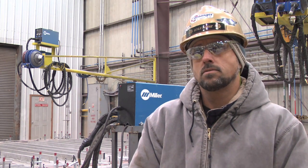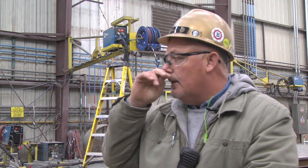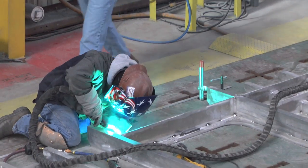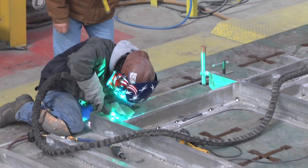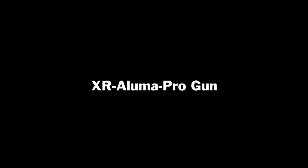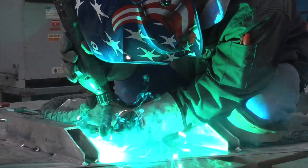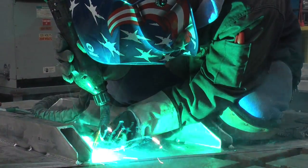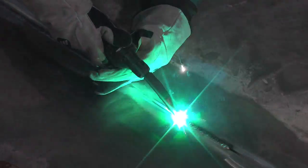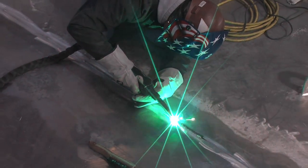One of the biggest challenges is distortion. I've seen a difference with this machine, and the distortion has been a lot better. This push-pull system that these machines have eliminated 98% of bird nesting — I just don't see it anymore. It also gets into some pretty tight spots better than what the older guns do. We have different nozzles you can put on there besides the standard one, including some smaller nozzles and a flex nozzle that gets into tight places.